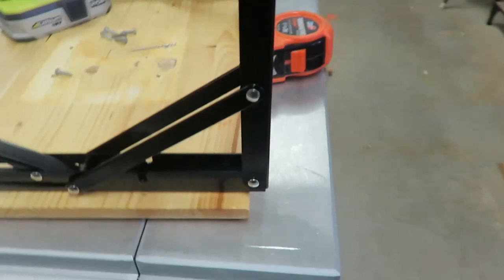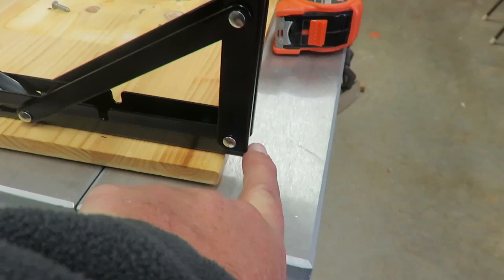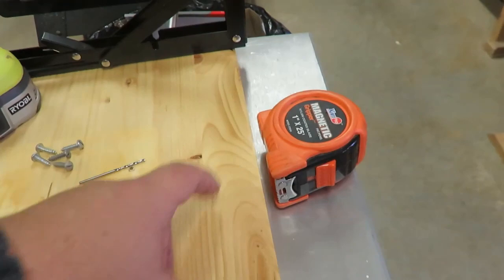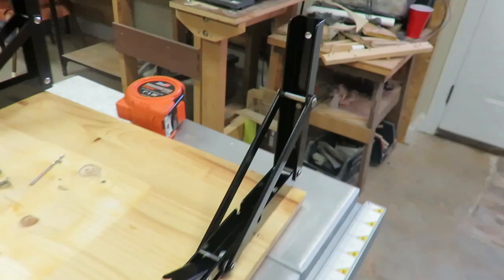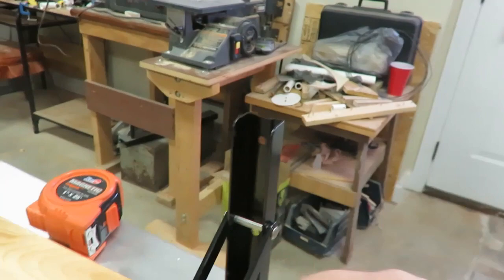I like these. Like I say, I left about a half inch gap here, which will give me a gap between the counter, but I just wanted to do that for that vent for the air conditioner. So anyway, I'm going to go upstairs, and we've got six screws to put into the back of here that's going to go into the cabinet. Now, if I wanted this to really be beefy, that cabinet's just got a thin quarter-inch paneling on there. I'm just going to use that to thread into these.